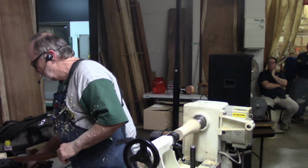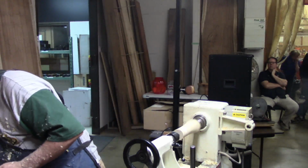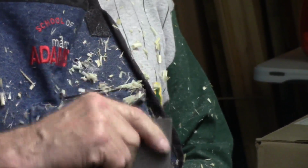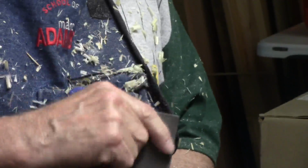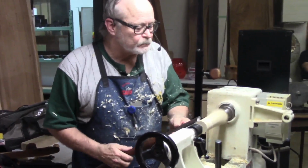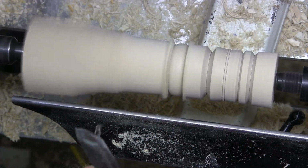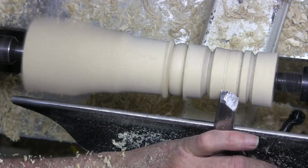So here, I really did land my little guy on the floor. Ooh, did I ever. Let's see if we can fix him without grinding him. This is probably one of the hardest cuts in wood turning, and people come to it prematurely. You want to come to this cut last with a skew, and you want to go to a smaller skew. So just in 2 passes, you can roll a bead with a skew. Now that's a very hard way to do a bead. So here's how I advocate you learn it. This is a slower way of doing it.